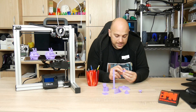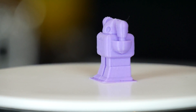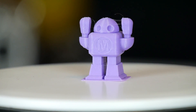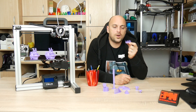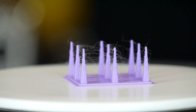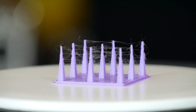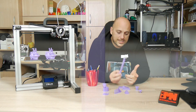The detail test with little Makey printed absolutely beautifully — definitely four marks for that. Every print has a brim because those are the stock settings, which I used as-is to see what happens out of the box. The retraction test, which looks at fine detail and retraction handling, did very well in terms of detail. I think once I tune the filament and retraction settings it could perform beautifully, though I can see very fine stringing throughout. Finally, the Z-wobble test, which looks at Z-axis play, printed beautifully and gets full marks.